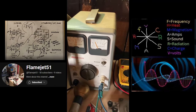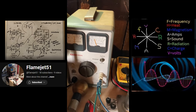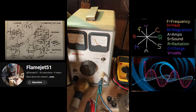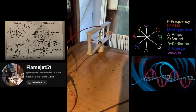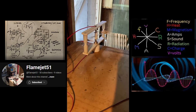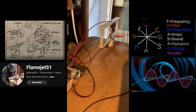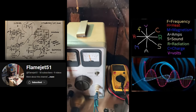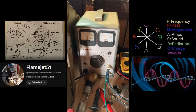As we lower the frequency, we get a raise in amps. Higher the frequency, lower amps, more volts. And a different style of discharge — you can see it's not super happy with that. Come back down a little. And look at that — we're back up to almost 8 amps. Thanks for watching, take care.